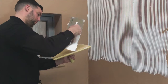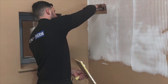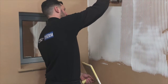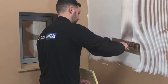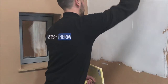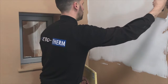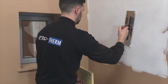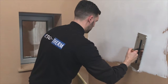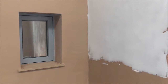When floating over, the main difference from conventional skimming is to remember to slow down. With Aerotherm there is usually a 20 minute working time, so you have time to slowly follow the trowel lines whilst applying a little light pressure. A useful tip is to put the handboard down before you float over, so you can focus on keeping all the Aerotherm on the wall and not scraping any back off onto the trowel. You should also not try to stretch the material further than the Aerotherm area you applied it to, as this may thin out the coating.